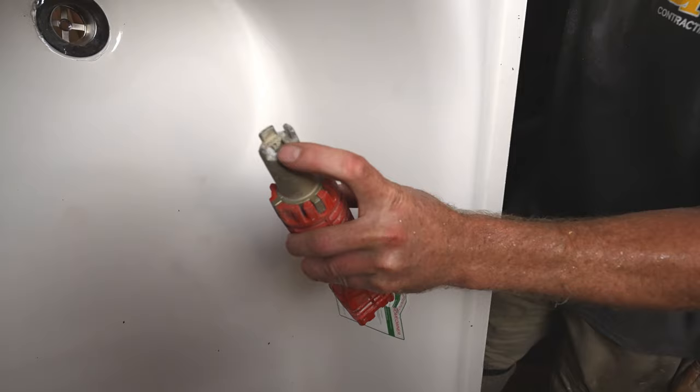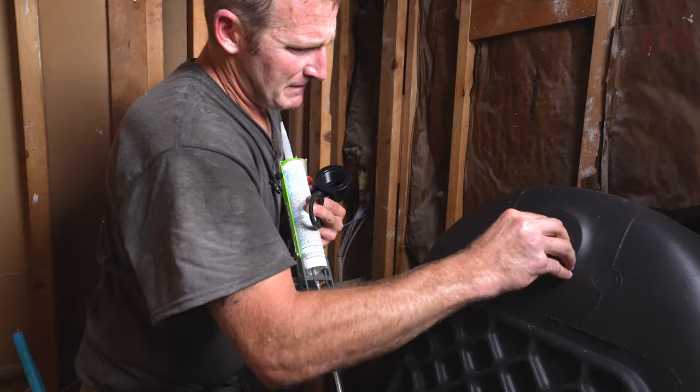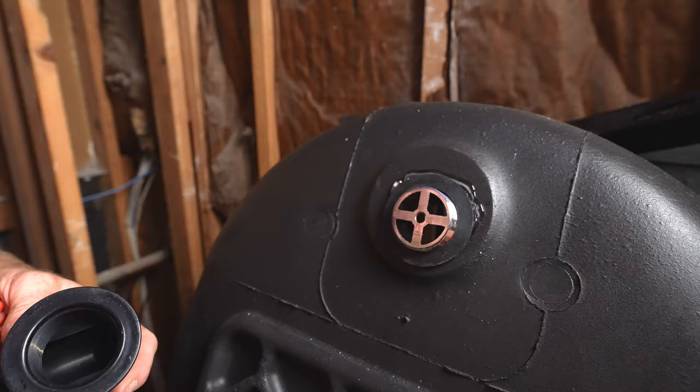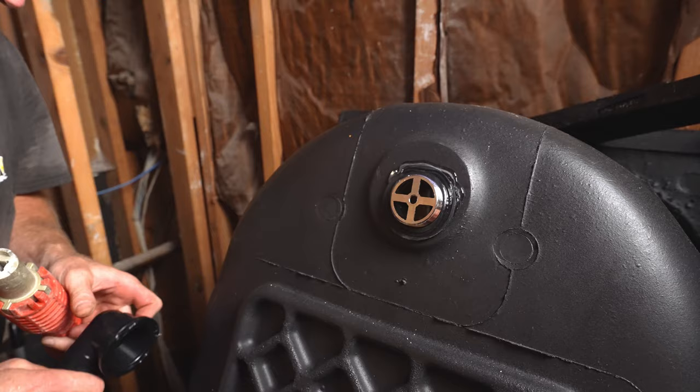This rigid tool actually snapped off one of the pieces, but it's made for a tub drain. This just allows you to put it in the crosshairs and twist. Then on the backside of the tub, put some silicone right on top of the bottom of the tub, and then put our rubber gasket. This is just for extra insurance — it might be redundant because it is a rubber gasket, but I just like to have this on all corners of this.